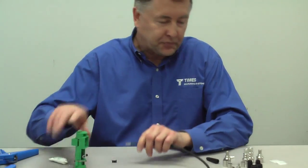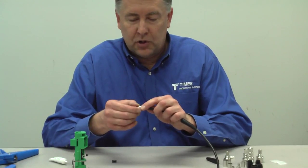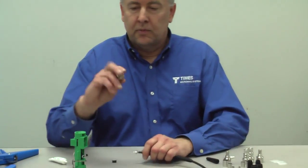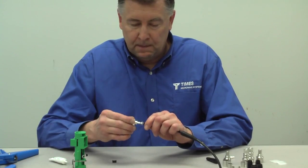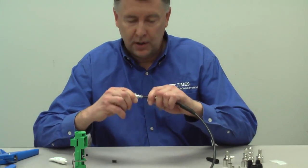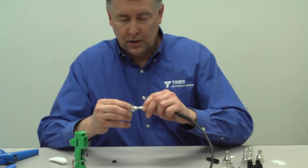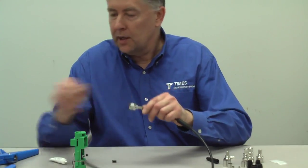just like so. At that point, you take your crimp ferrule, place it over the cable, just fan out your round wire braids. You take your X-Series no braid trim connector with the ribs in the back. Get it started. Go ahead and push, you feel that stop. Give it another push. That's those beryllium copper spring fingers riding up on the center conductor. Bring your ferrule up. No need to trim the braid wires, they're right where you want them to be.